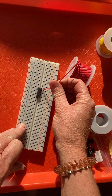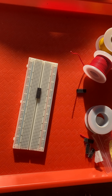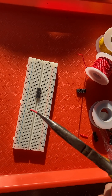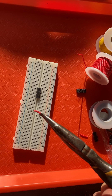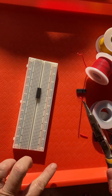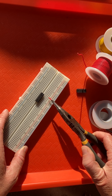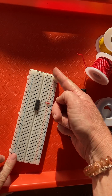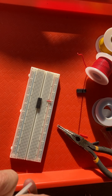A lot of people would stick a big wire close to the chip and run it all the way over to power, but I don't like doing that — power and ground are just something you need, like a battery in a cell phone; it shouldn't get in the way of your work. So I recommend making little tiny pieces of wire bent at 90 degrees with needle nose pliers — a little jumper. From the pinout, I need to electrically connect pin 14 to the power strip, and there we go — pin 14 is connected to power.